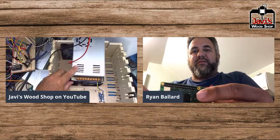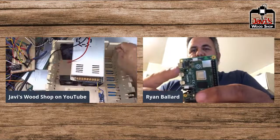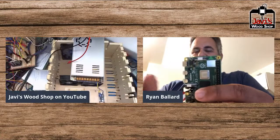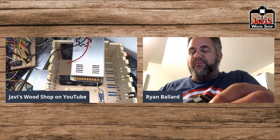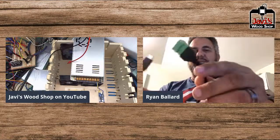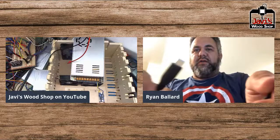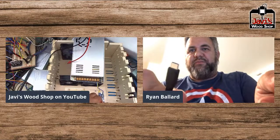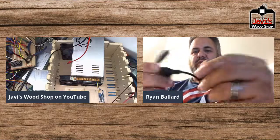But other than that, it's a fun thing. With the Pi 4, you have the USB-C port for power. Yes. And I'm trying to just streamline my whole controller. So I got this little guy, a breakout connector, so you can wire it in. Got the USB-C here. That's how I'm going to wire one of the buck converters up for this. Ah, that's perfect. I don't have the wall wart and everything else inside there. Yeah, you don't need it.